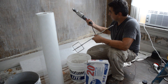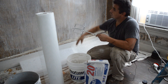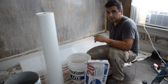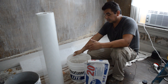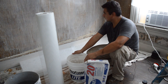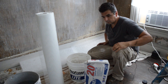Once the bonding adhesive is tacky, you're going to put a little bit of the new mixture on top, bring the mesh all the way up, and then start covering the entire mesh. Make sure that you have the seams fairly close — you don't want them spaced or overlapping too much because we're dealing with different layers. You're going to need a couple of buckets of compound and some of these bags to start mixing. Don't rush too much — it's a lot of work, but don't rush it.